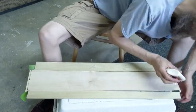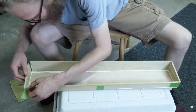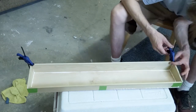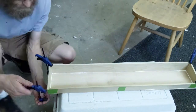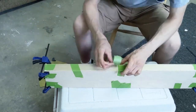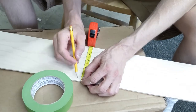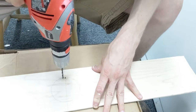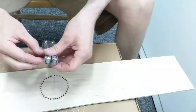Any wood glue will work — this one was Gorilla Glue. I only had four clamps; ideally you'd have more, but I clamped each of the corners and taped down any gaps where it wasn't completely touching, and left that overnight. It was very solid the next day. I was thinking of using screws, but when I screwed into it, it started cracking — it's a little too thin for screws. I measured the center for the sounding port, drilled it out, used a small saw to cut through it, and sanded it with a file.